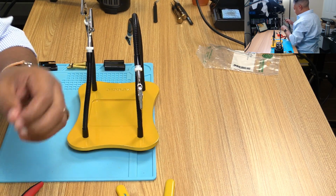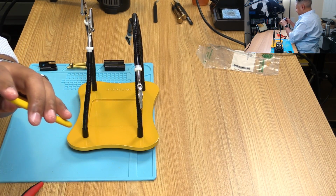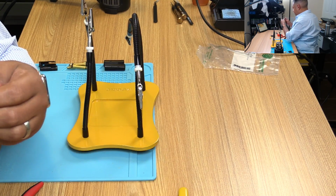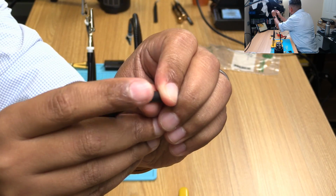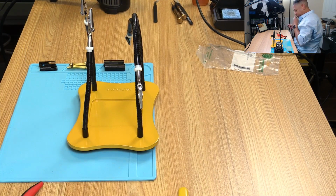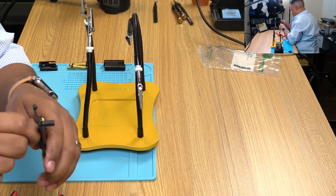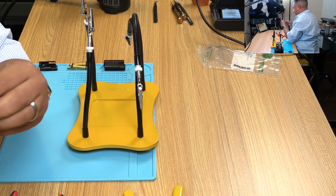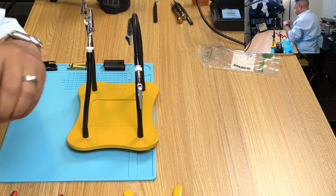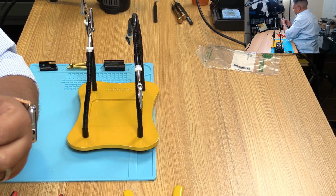No, that doesn't look like it's going to work. So I'm just going to have to start again. I'm just going to be super careful as I roll this tip around. Yep, so, alright, I made a cut that doesn't go all the way, which is good. So I know I didn't cut any copper. See if I can work that. Perfect. Alright. If I just force it, I can finish breaking it here. There we go. Alright, and this time I didn't cut any of the copper shielding. Alright, so that's great.